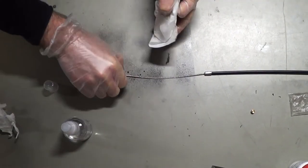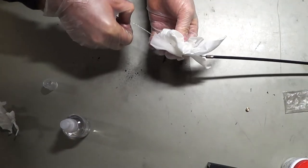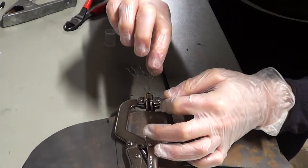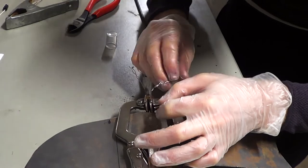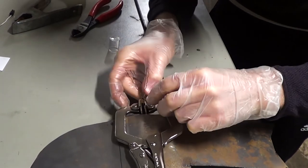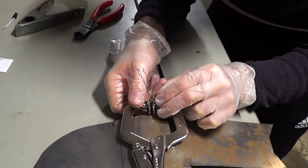After that it was time to prepare for the soldering. I used IPA to clean both the wire and the terminal. Then I used a pair of vice grips for positioning, and started to fray the wire. This will hopefully add a mechanical lock to the joint, to help keep the terminal bonded to the cable.